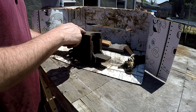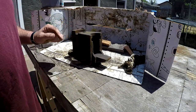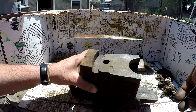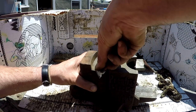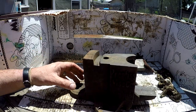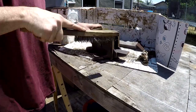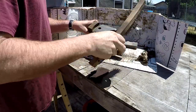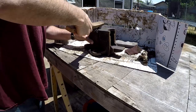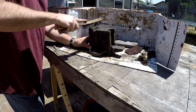So the first thing I like to do is use a razor blade on the flat machine surfaces — scrape it, that will get quite a good bit of it. Let me move you guys in so you can see the powder that's kind of coming up. So that's removing damage. I'll go over that everywhere there are machine surfaces — there's not very many on here. Then I'll go over it with just a hand wire brush, and if it's done, that will pretty much get it nice and clean. You can see that's nice and silvery now.